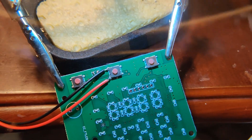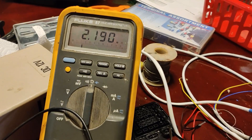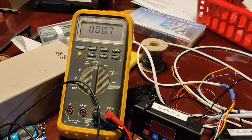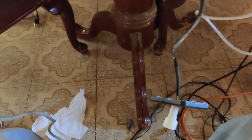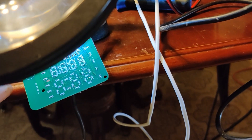I've got the wires soldered on there. Right now with my test meter it's sitting at about 2.19 ohms — hardly anything. When I push the button it goes down to 0.7 ohms, so that's making the circuit across the button contacts. Now I'm going to bend these wires and route them out the side of the controller.